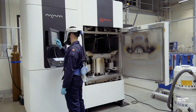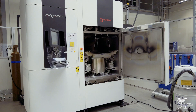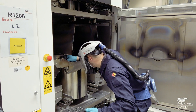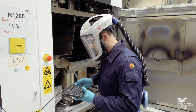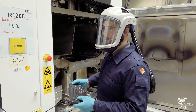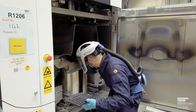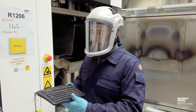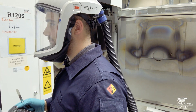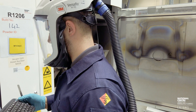After preheating has started, the build will cycle through typical actions for each layer: preheating, melting, melting of the supports, raking, and then lowering the table. In this case it will lower by 90 microns and it will repeat this process for each layer until the build is complete. In an additional contrast to LPBF, the beam is controlled by electromagnets compared to mirrors. This allows the beam to have a much faster translational speed — going from tens of meters per second up to almost 8,000 meters per second — allowing the build to maintain multiple melt pools at once.